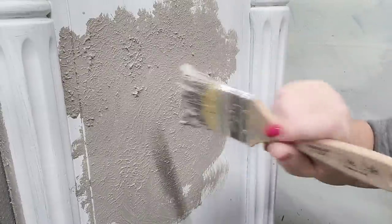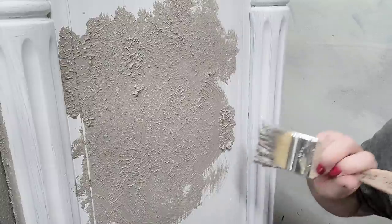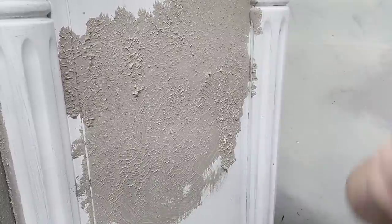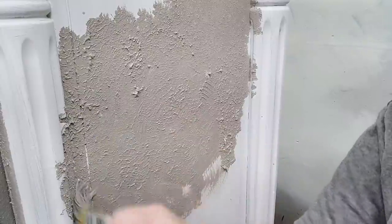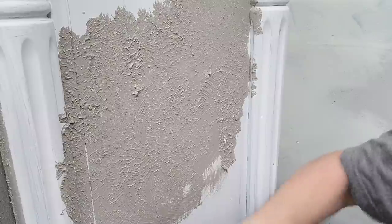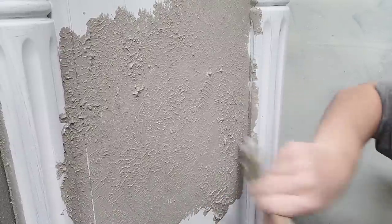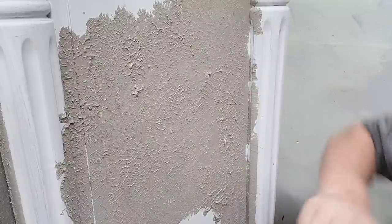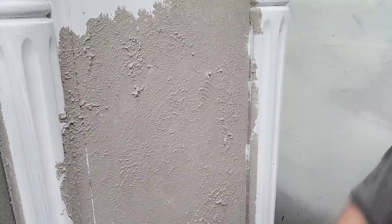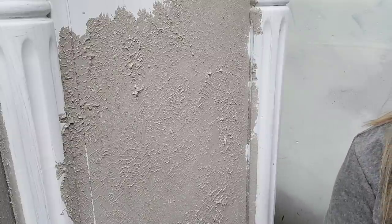I'm going around my entire side using the stippling motion. In some places I want to leave the texture a little bit thicker than others to give me extra raised areas — I don't want it completely even. My coverage doesn't have to be perfect on this coat because there will be another coat of paint going over the top. This is my undercoat, not my final color. I'm using the darker color so it will peek through — I'll be adding a creamy off-white over the top and then sanding it back.